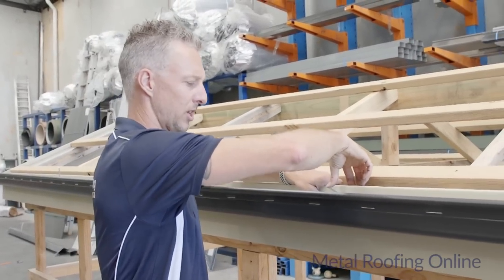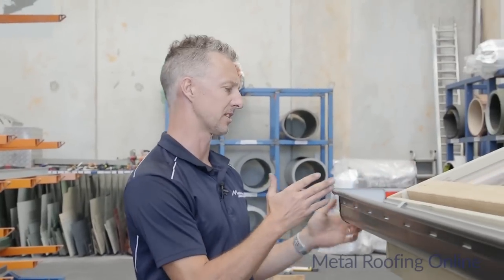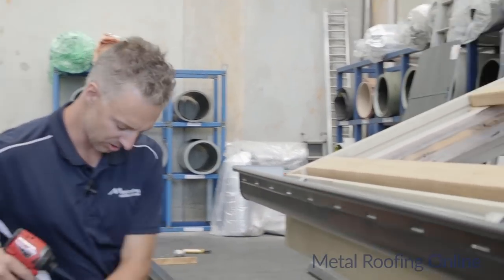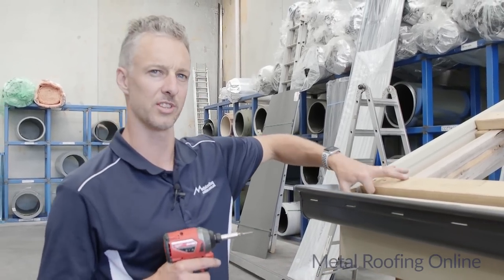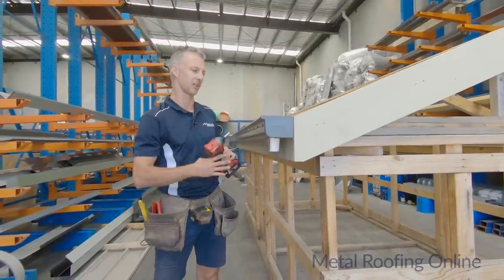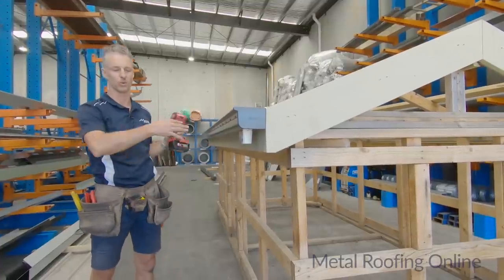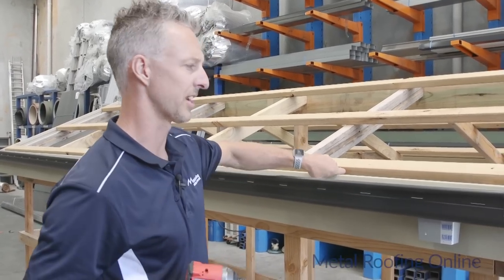With this part of the clip you just bend those over the top of the gutter. I've double-checked both sides and I've got the gutter about 8mm past the end of the fascia on both sides so that the barge capping meets up nicely. Once you've got it in the perfect position, put one of these screws through the back of the gutter and into the fascia so it holds it nice and tight — especially down at the end where you've got the downpipe, because putting the downpipe on can knock the gutter off the clip. If you've got a 10 or 20 metre long run, put one of these screws every four or five metres through the back, but on this one one at each end should be fine.